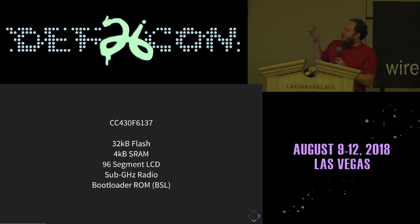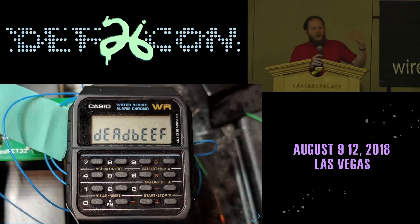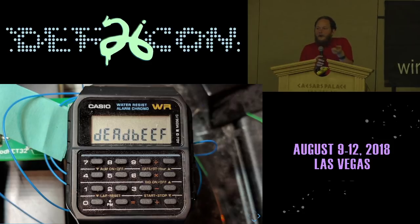It's important to keep it to as few devices as possible because the chip packaging takes a lot of surface area on the board. And also a lot of vertical height. So I didn't have room for another chip to have a separate radio and CPU. They really had to be the same device. And similarly, I don't have room for an external LCD controller. So I had to find a part that contained the CPU and the LCD controller and the radio in a single component in order to fit everything. And that got me a watch with a working display, with working keypad inputs.